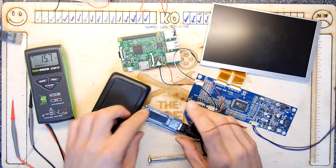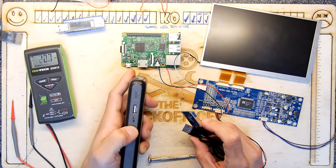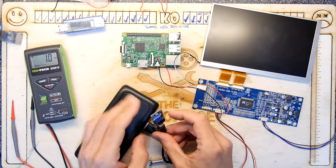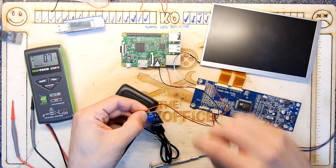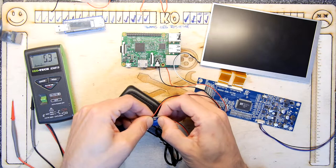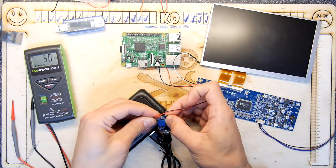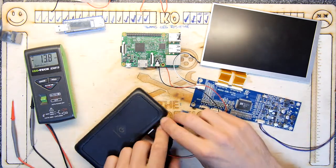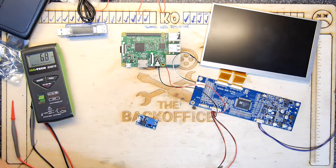That's extremely odd. So you can see this current meter's died. Let's just check this — it's saying it's got full power. I'm wondering if it just draws too much current. So I'm going to have to hook this up to the bench power supply. I'm going to try the V-in and V-out tabs on this with a bench power supply.